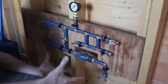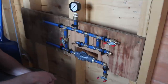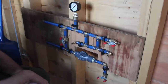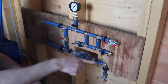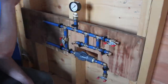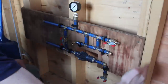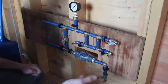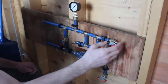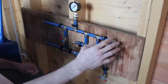I'm not 100% certain how it's going to work or if it's even applicable to such a small system, but the way the guy described it convinced me it was worth doing, and it's hardly any extra work to put in a couple of extra tees. What we've got here is that the kitchen sink is going to poke straight off here and connect via a braided line to the fixture. Because we're underneath the kitchen cabinetry, this will come out and then go into a stub going off to the shower, and that carries on to the toilet room sink. This line has a shutoff because it's going to supply the water heater, so we can always shut that off if we need to do anything to the water heater.